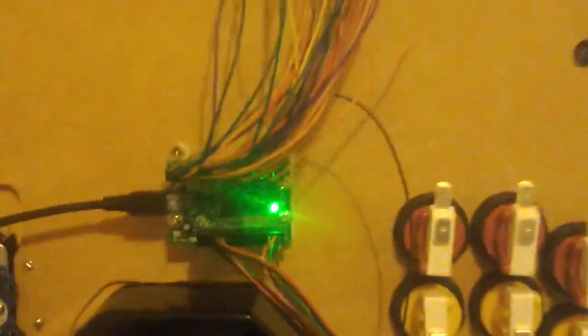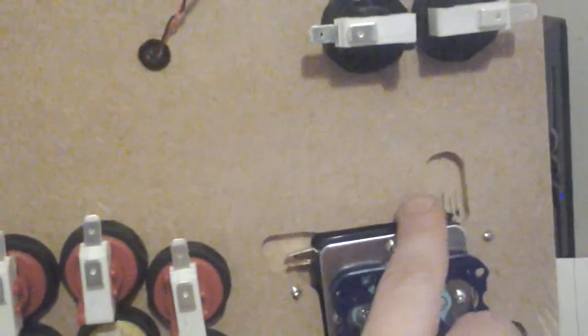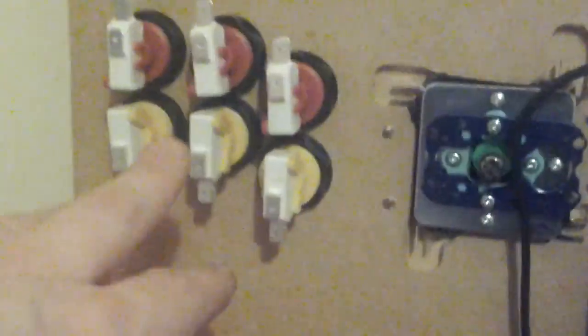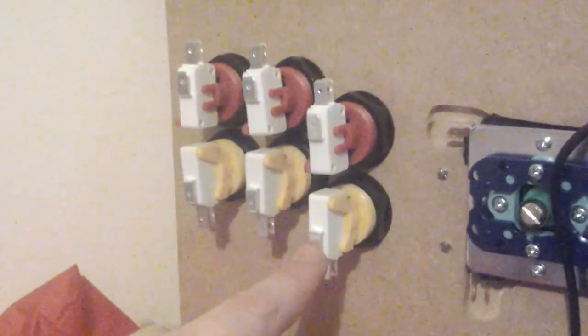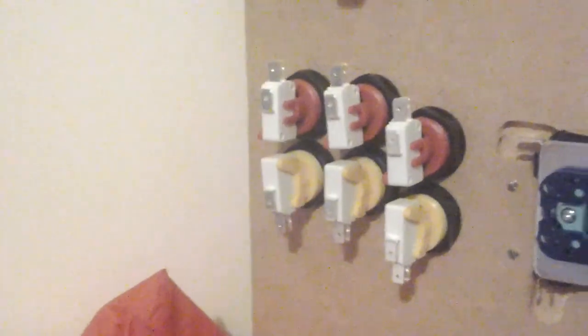Okay. So just to show you how I done it, a quick thing by the way: the joysticks have just got two spades on each one. Each one's an axis, up, down, left, right. The buttons, however, actually have three prongs. This one here is the ground, so you put your black cable in. It's the common ground, and they all go to one pin on the mini pack.